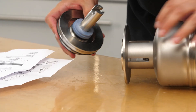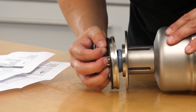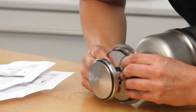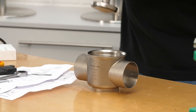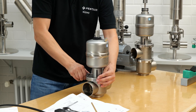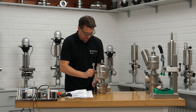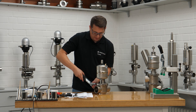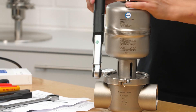We can pull the product side back up front. If you look through the lantern, you see the orientation of the fast coupling — you'll find that almost immediately. Push that up — you don't need air in this case. Make sure you're also not over-tightening the clamp. Torque meter: 8 Newton meter — I already said that. That's it.